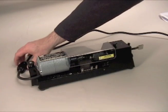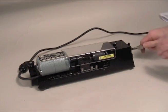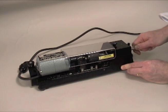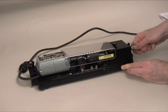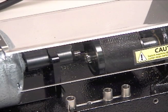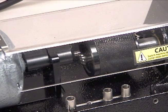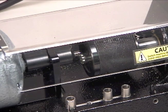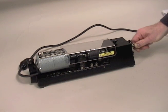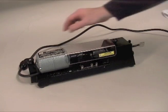Close the safety shield and turn the machine on. Turn and push the original key so the first cut fully engages the stop pin. The key blank will be cut to a corresponding depth. Slowly release the key. Turn to the second space and push in until the cut fully engages the stop pin. The second cut has now been made on the blank. Continue this process until all 7 cuts have been made.